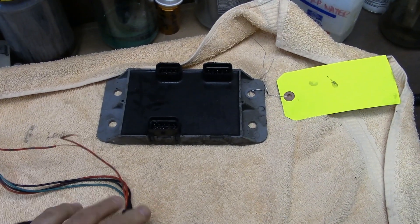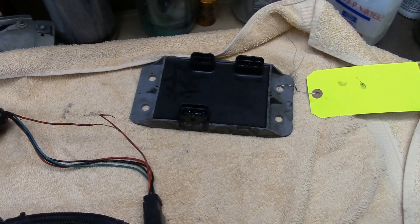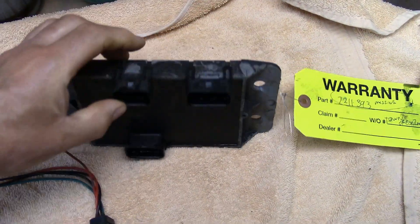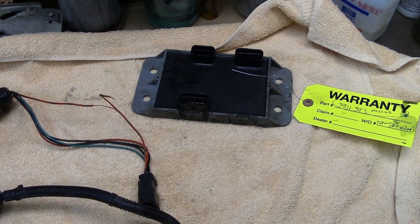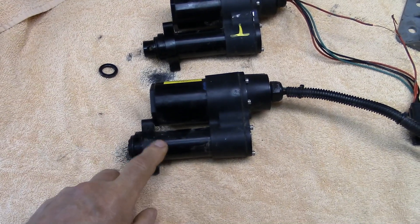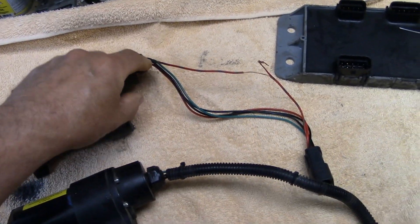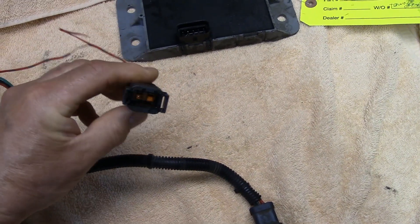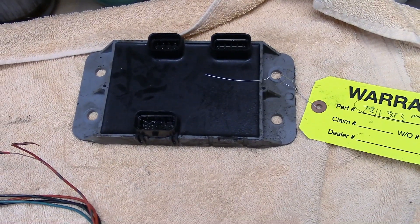The controller is about a foot or two away, and two connectors link to a harness that connects to the controller. Some wires also go to a second main controller. I found this thing was very oily and couldn't understand why — it's a sealed controller circuit board. I finally realized the oil pressure from the hydraulic valve, with the seal not doing its job, went through the actuator, through the electric motor, through the coating on the copper wire, and through the connectors, which were covered with oil.